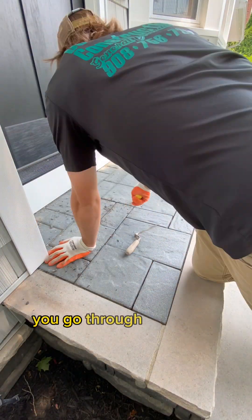Now we're going over again with the whitewash brush, fine-tooth combing through each joint line. You want it thin — about an eighth of an inch below the paver. Now it's all brushed in, all nice and done.